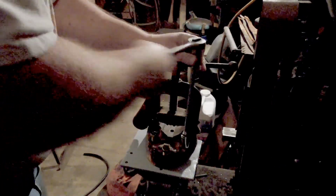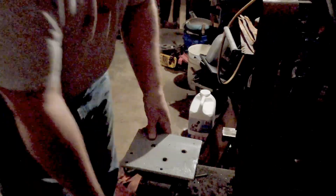Got the jaw blank cut out, ready to go. I need to drill the hole. Before I can do that, I gotta mark it. So I gotta pull the vise off the vise plate. So the pipe vise unbolted, I can reach to the hole, mark out the plate where the bolt goes, and then I take the jaw downstairs, drill it, tap it, and we're ready to go.